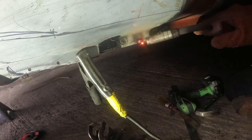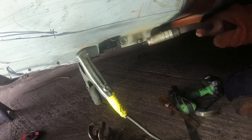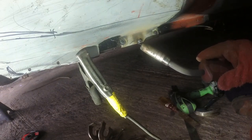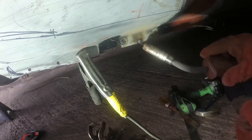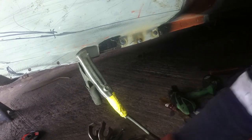You can see these little stalagmites, stalactites, whatever, dribbles. That's the impurities from the paint carbonizing, making gases which then blow out, and as they expand like little volcanoes and push the molten metal pool ahead of them, which is really annoying, because if you set that off, it will probably end up looking like an aero bar.